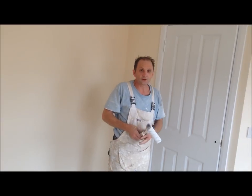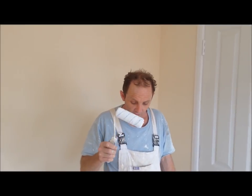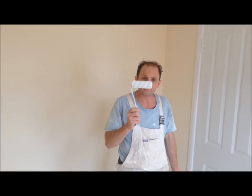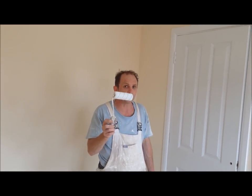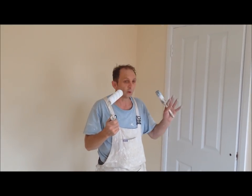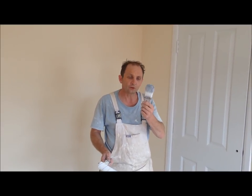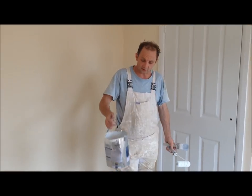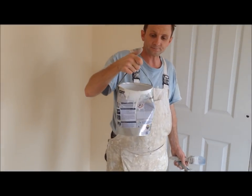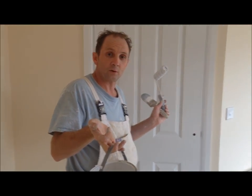One thing you're going to need is a roller adequate for doing it in gloss or eggshell. You may need to watch my other video on how to paint a staircase — that will tell you exactly what type of roller you want. You'll also need a good clean glossing brush, so you don't want bits coming out of any of these things. Watch another previous video for how to prepare your tin to use as a scuttle or roller tray.